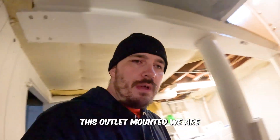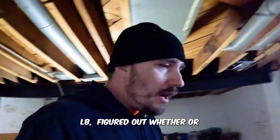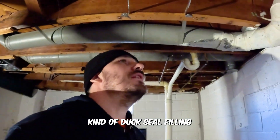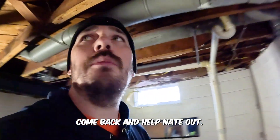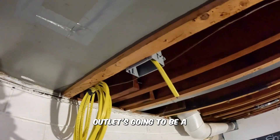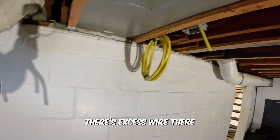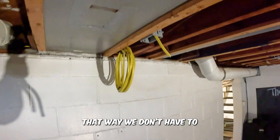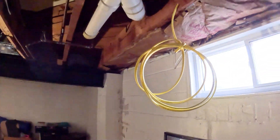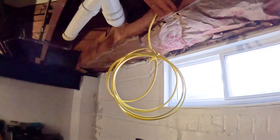After we get this outlet mounted, we are going to go outside and look at that LB. Then once we get the LB figured out — whether or not there's going to be any duct seal filling — we'll seal that up and come back and help Nate out. We've got a coil of wire and an outlet that's going to be right here. The outlet is temporary until they get the walls built, so there's excess wire so we can bring it down in the future without having to splice it up in the ceiling. There's also a future outlet placement dead-ended in the panel with the breaker there for future hookup.